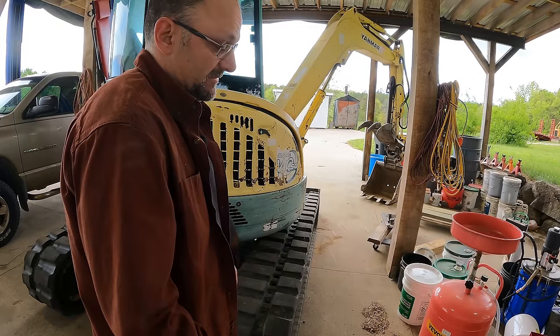Now I wish I could put one on the right, but I don't have another adapter to go to a second gauge. Let me think if there's a reasonable way to do that. The thread that goes to the test hoses and the gauge is a 16x2 metric thread. I obviously don't have a tap or a die for that, so that's a tough one to make. But I've got a bunch of other adapters that go to other things. Like that's a 1/8-inch pipe thread. I've got a tap and a die for that.